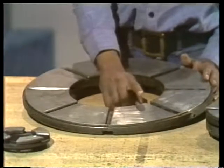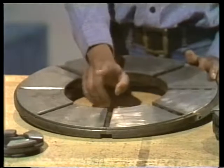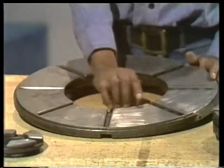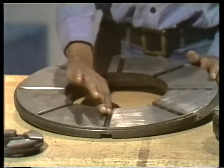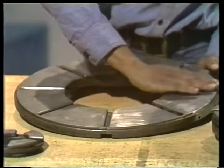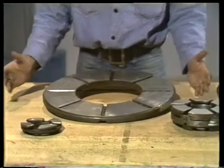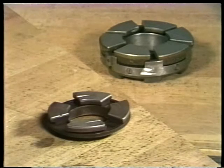The lands for which it is named are the areas between the grooves. This bearing is made of babbitt bonded to steel. Lubricant is pumped into these grooves, and one edge of each land is slightly curved so that lubricant can get in more easily. As the collar turns, lubricant sticks to it and is drawn over the collar and the lands. Flat land bearings come in all sizes — this one is big because it carries a heavy load.